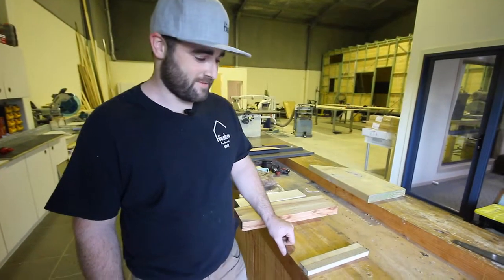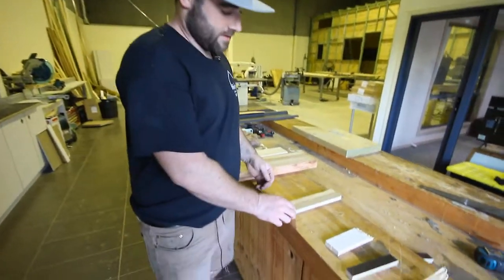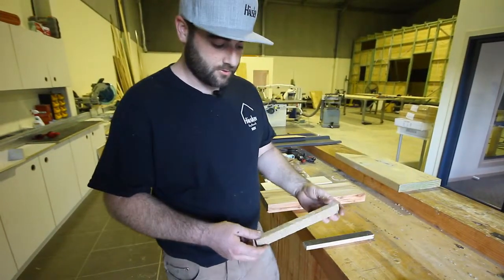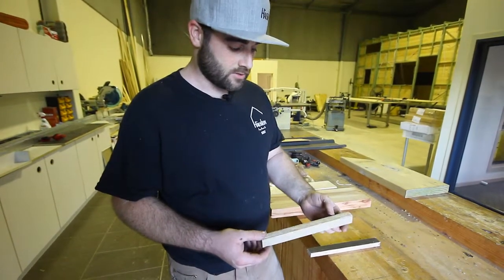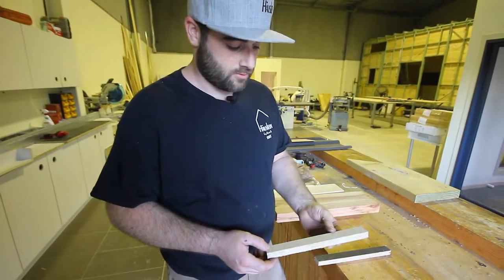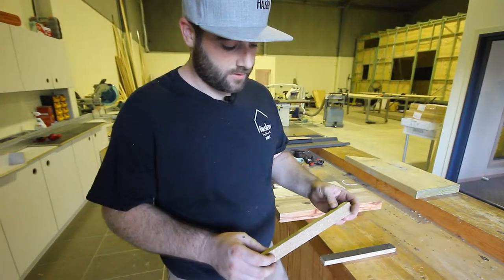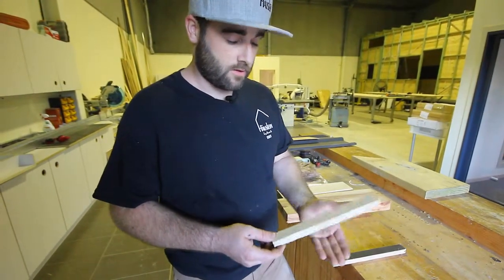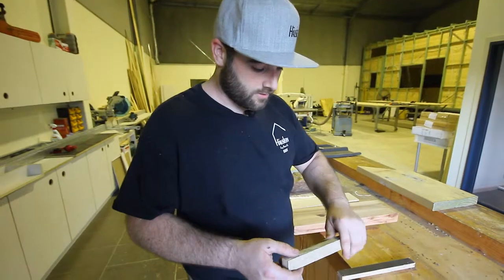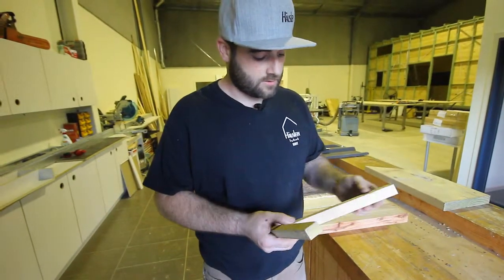So where we were — the interior cabinetry, Rhino Ply versus chipboard. Moving on to what we use for flooring. Typically in a new build you'll find chipboard flooring, and it's not a terrible product but it is still chipboard. As far as I understand, they're legally required to be rated to tolerate a certain amount of weather, so the glue used is probably waterproof or very water resistant. However, in terms of strength, it's not as strong as plywood.